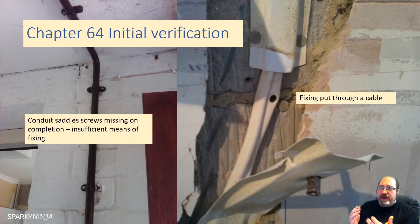For example, if you're doing a kitchen and putting in half a dozen spotlights, you want to inspect those connections from an initial verification perspective - maybe before you even put the lamps in, carry out an insulation resistance test between live conductors, and then push and snap those lamps up. Because later on you're not going to be able to remove the lamps without damaging the ceiling. On a new installation, we should not carry out a limited insulation resistance test between line and neutral because the lamps are in. That's not acceptable - we should do the test before the lamps are introduced. On an initial verification, we should only be putting in ticks and not-applicables, not crosses or 'not verified' or 'limited', because that's suggesting we've done it in the wrong order.